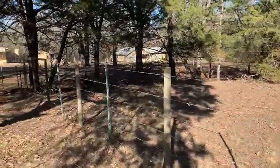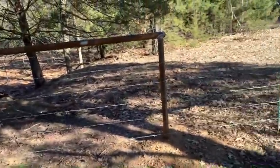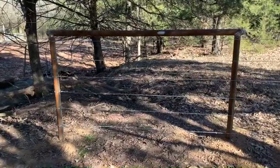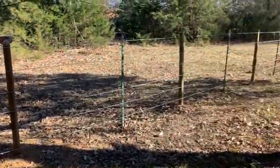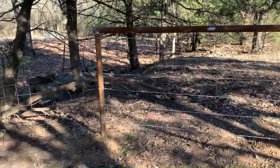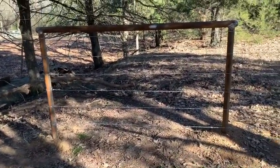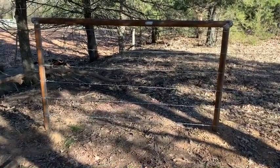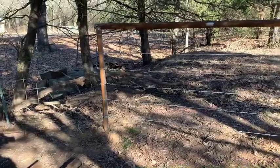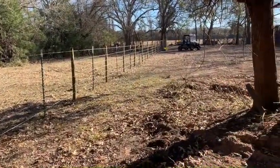You can see here — same thing as that one — we came in here, welded up some end posts, put them on eight-foot centers for that little short span and that should hold. Normally I would use three posts: the one that the wire is anchored to and then two dead legs pushing back. But in this case, that's good enough — the fact that it's eight feet apart, that's a two-and-seven-eighths drill stem, thick-walled pipe, it's not going anywhere. The end pieces have two 80-pound bags of concrete in them; that one has one 80-pound bag. So it's holding — that little section of fence looks pretty good.